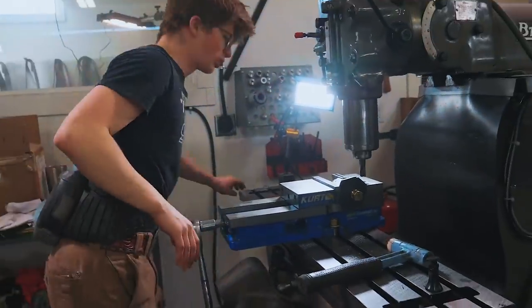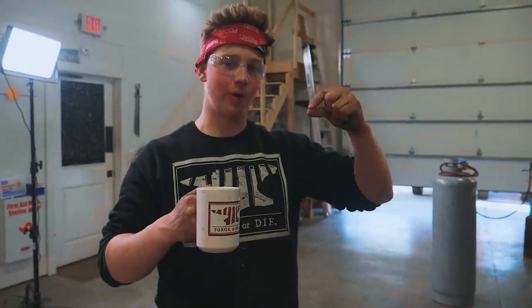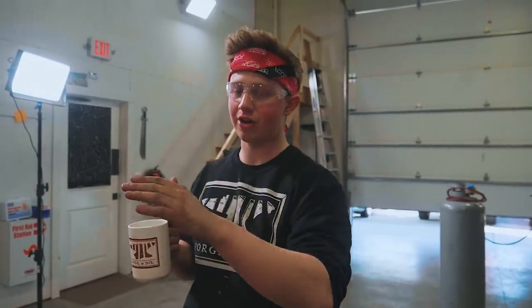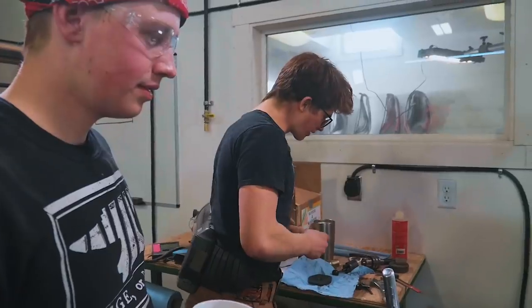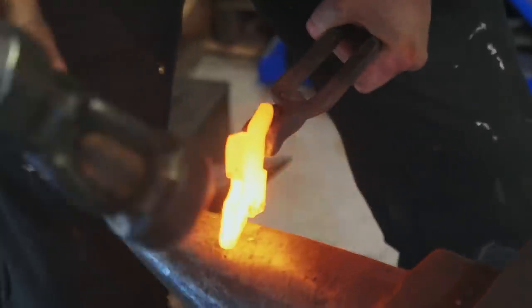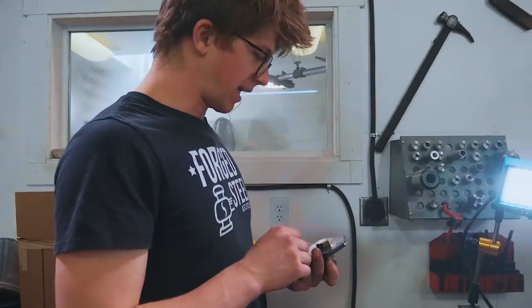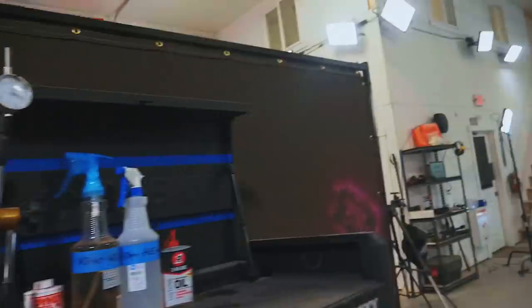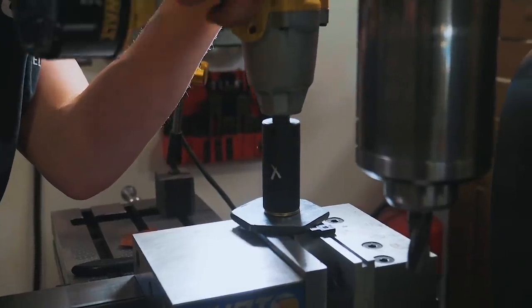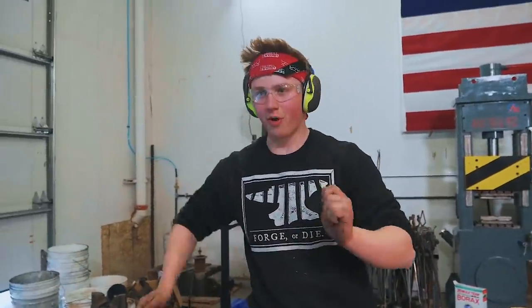It's okay, I think I've got another solution. This is not good — I have 45 minutes left. I just threw my star back into the forge because I don't think I drew out those points far enough. I'll be able to forge down the blades a little bit more and then go back to the grinder. I'm milling about just a little bit — not going so well, to be honest. We only have 45 minutes remaining. I'm widening out those blades, making them a little bit longer, thinning them out, just getting a little bit more meat.